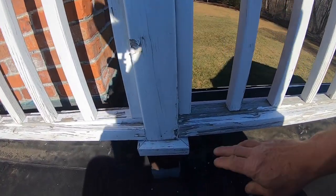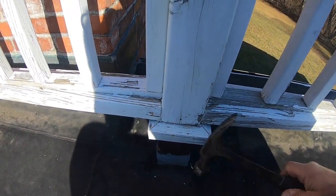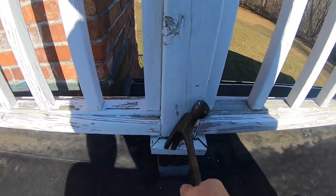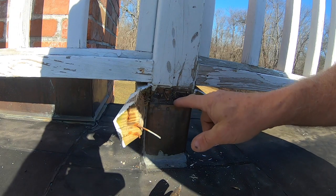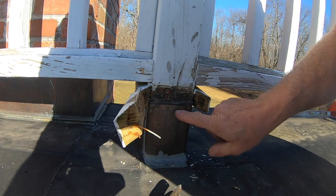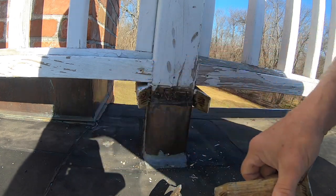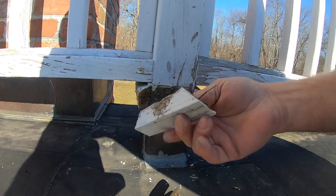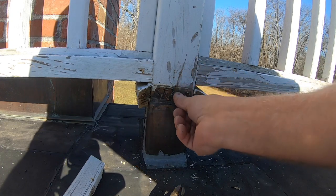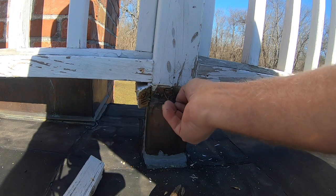In this case, they added this piece of wood to cover this flashing. Caulking never works and this wood didn't work. They put caulking here — the transition between this copper and this post is caulking. They covered that with this wood, which is good because it protects the caulking. But water still gets in there. You can see it's wet there and it goes right behind the caulking.